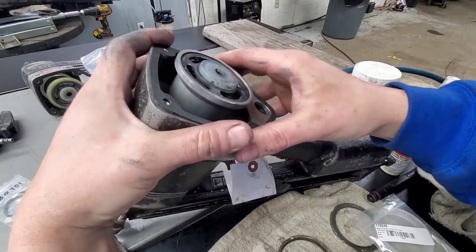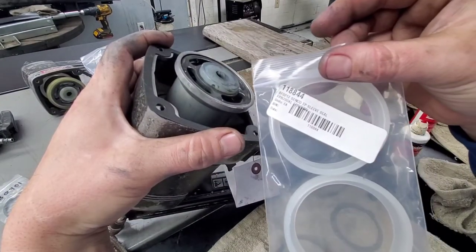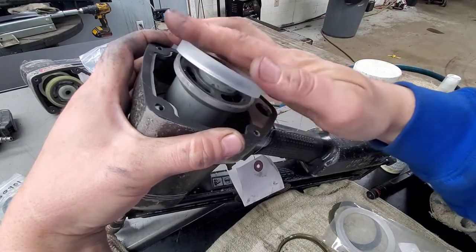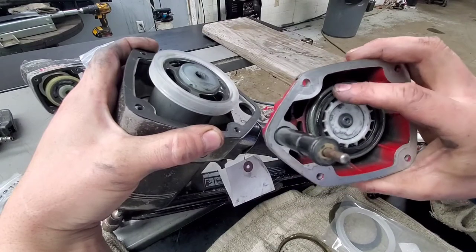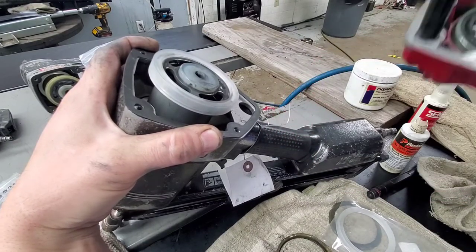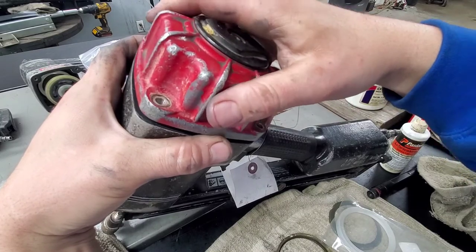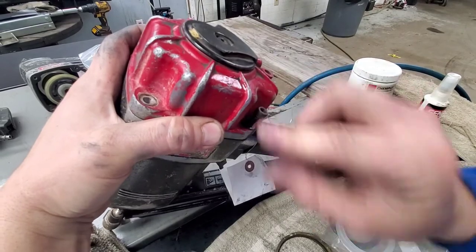So the top sleeve seal here, that's the BF0212. That's the one that was broken around here. So that seals from the cylinder here up to the top of the unit. So that seals from there up around to here to this check valve seal here around. And that's a BF0203, I believe, if it's broken. We normally just get the whole top assembly if that's broken. You can put this back together here, just get your screws.